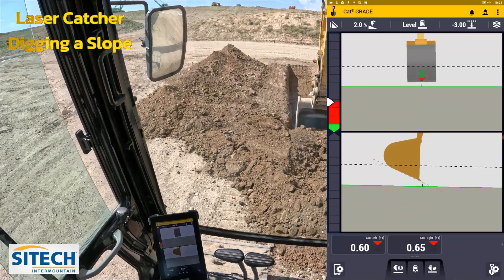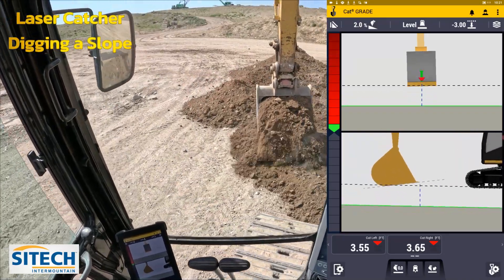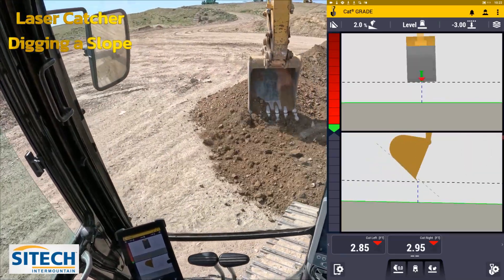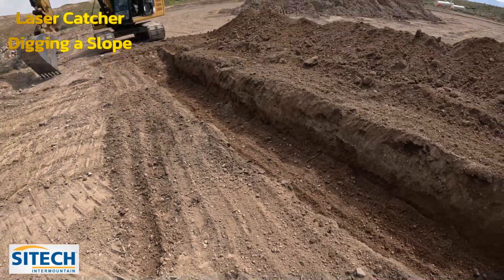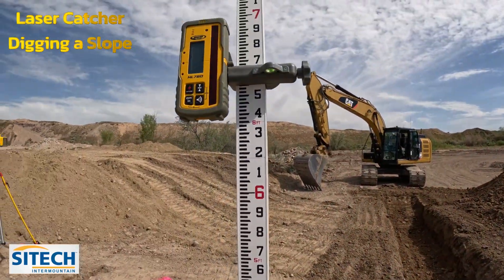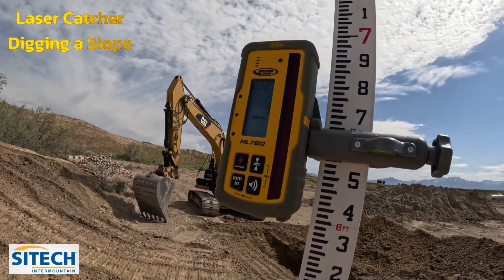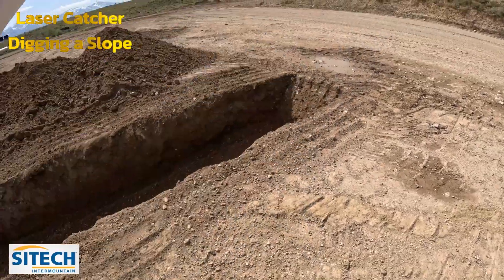Let's take one more pass here, and then we'll grab the grade rod just to give us the warm and fuzzies that it is actually doing it right. Everything right now I'm doing straight off trusting the machine and the laser. We'll clean up the edge of this trench. Now we'll go grab the grade rod. Now that I've dug this trench in, I just want to verify it is on a 2%. I'm going to use my traditional laser pole, set right up off of this elevation and zero out — we've got a clear tone. Now I'm going to add 3 feet to this pole.